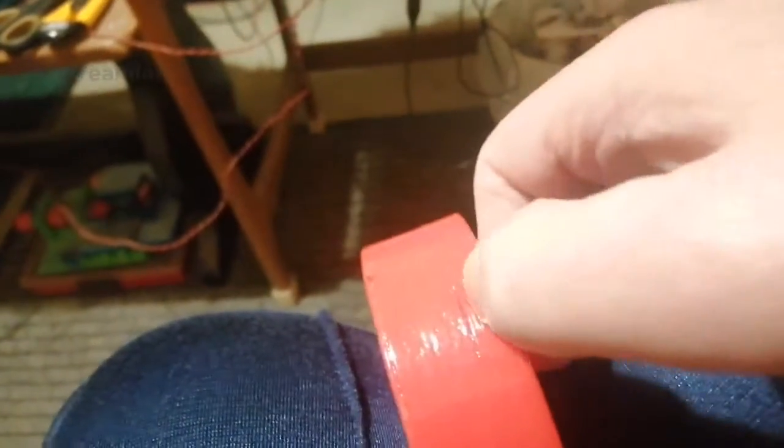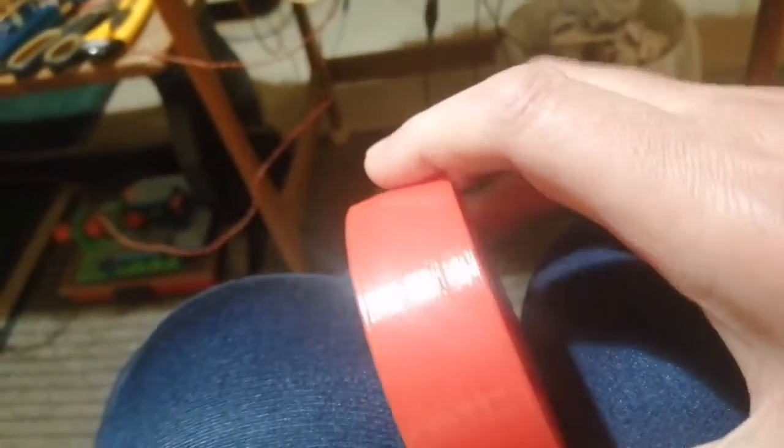Right. So, what happened, as it was printing, I know it started to open up there. There's a little tiny fracture there, but that's no problem. The acetone sealed the gap. And the structural strength, I don't need structural strength in this plane. The structural strength is in this plane, so that's fine. It doesn't matter. The cracks won't weaken it at all. Let's see, all the way around.